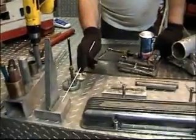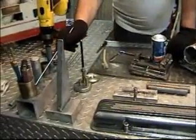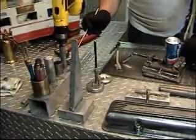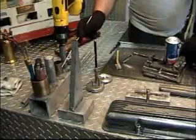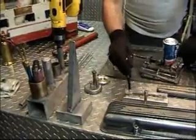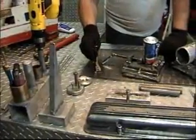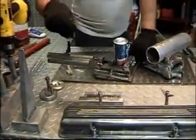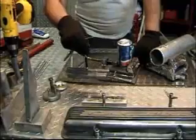You can use this rod on all alloys of aluminum. It can also be used on brass, copper, pot metal, white metal, zinc, and die cast aluminum. You can mix dissimilar metals as long as they're non-magnetic. It works on non-magnetic materials with the exception of stainless steel — it will not adhere to stainless steel. The one magnetic material you can use it with is galvanized steel.